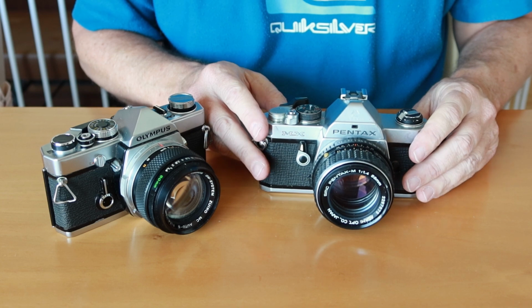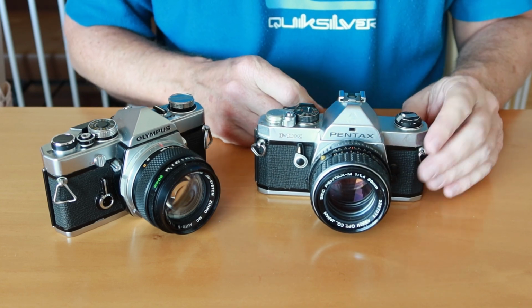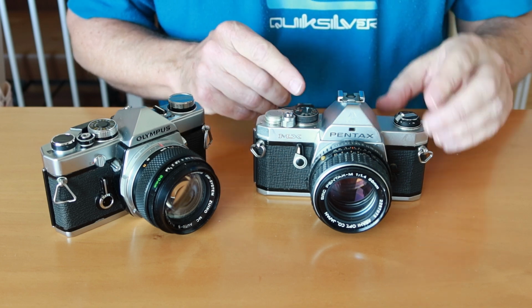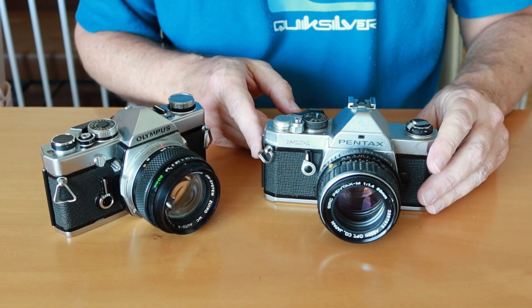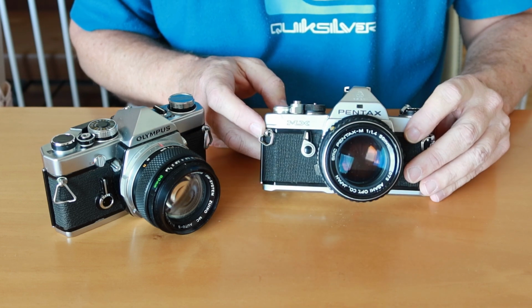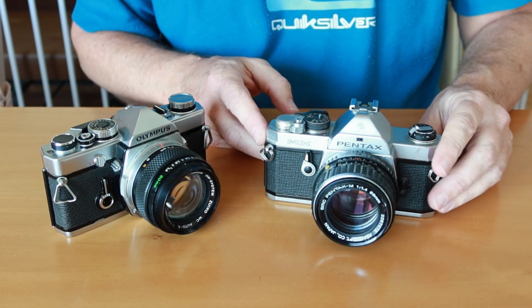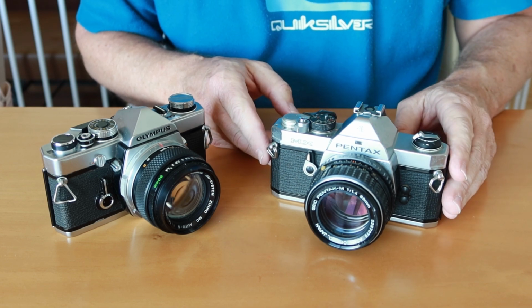It depends on the cause. Often the cause of the stuck shutter is gum in the mechanism, and the mechanism inside the MX is quite complex and difficult to clean and service. And though I've done it a few times, I'm always pulling out my hair when I'm trying to get one of these cameras fixed and operating.